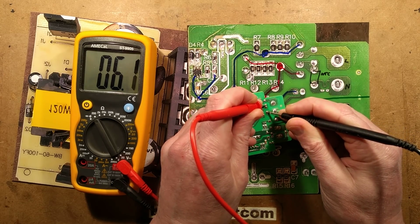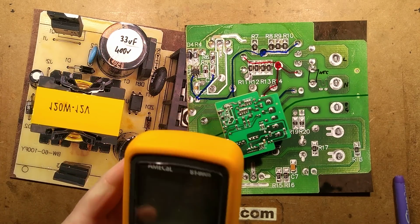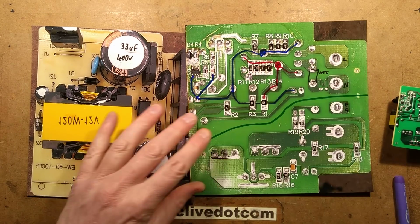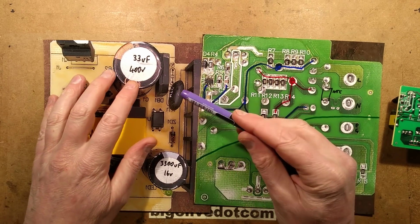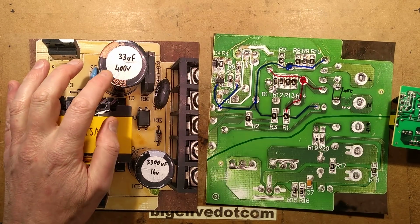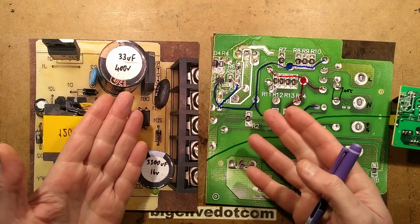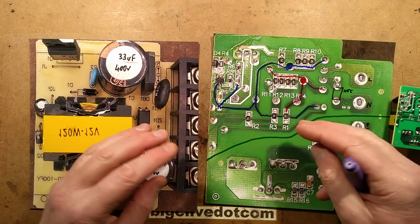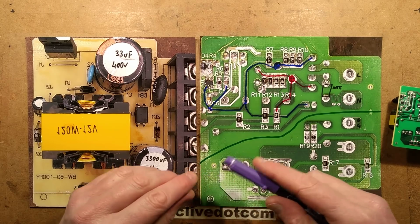It's about 6 ohms minus the sort of lead resistance. Let's say 5 or 6 ohms. It's really not that much, but it makes a difference. When you first turn a power supply on, this capacitor is discharged, so initially the current will want to charge that up and it will effectively short out the supply briefly. And if you've got a lot of these power supplies in one circuit, the potential for an inrush current could be enough to actually cause the circuit breaker to trip out magnetically instantly.